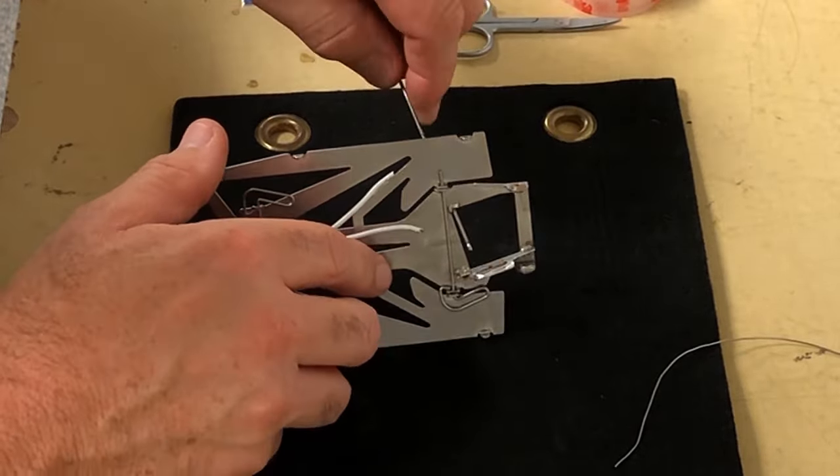So these are pre-tinned. And how I've done all the other cars that I've built is I take these and I loop them around so that in the case that the guide flag gets pulled really hard, or if you run into a situation where your guide flag wire comes loose and it's because it's broken and you have to replace it, then all you have to do is just pull a little slack out of here.